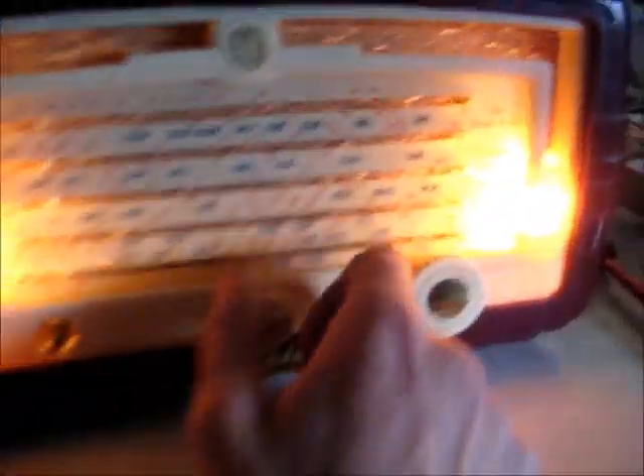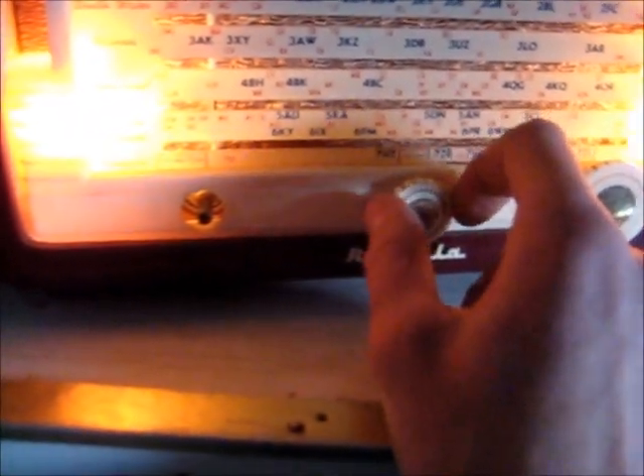Let's turn it on. This model right here does look very good in the dark. And it's contact cleaner. I was supposed to be spot on there, but I think it was probably shifted off the fascia about 5mm, so it's a tiny bit off the dial line but not too bad. That volume control is very intermittent - I've got to get that. I've got to get the tone control knob, clean that out with some contact cleaner, and the volume control because it needs a lot of attention. It's not so bad now, but at a certain point it will crack or just stop.